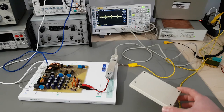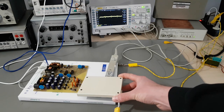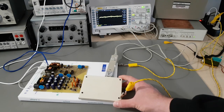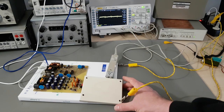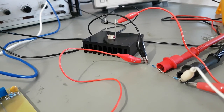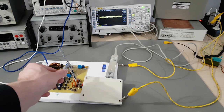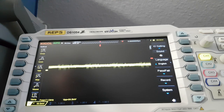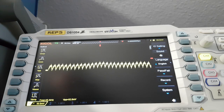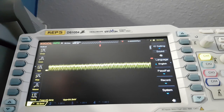The converter is done — let's check performance. Using an HP differential probe AC-coupled to check for noise, with a minimum of shielding I'm getting as little as 80 millivolt peak-to-peak on a 1200 volt rail. That's truly fantastic. Even under full load of 10 milliamps, the noise doesn't get louder, just more frequent. In a full enclosure the output noise will likely be even lower, and there's also additional filtering on the output module — which is why I had to buy more expensive high voltage caps.